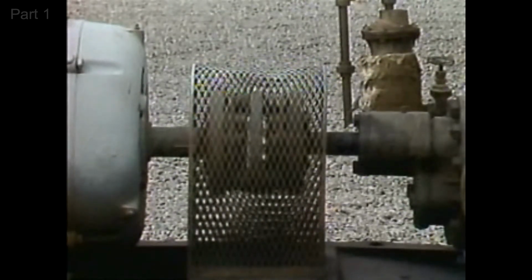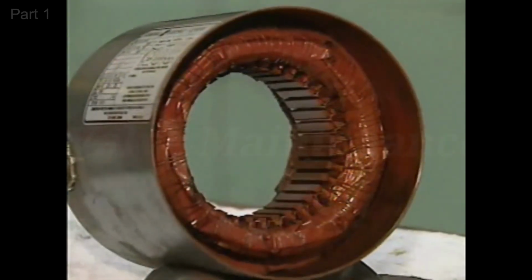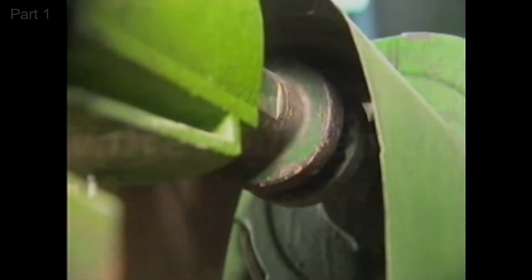When a typical AC motor is first started, current is 3 to 5 times higher than the motor's normal operating current. This surge of current could trip the power supply and in some cases may damage the motor's windings or the cables leading to the motor. In this part, we'll look at a reduced voltage start AC motor controller that can protect a motor against these current surges. Reduced voltage start motor controllers generally use resistors in series with the motors they control. The resistors increase the resistance in the motor circuit, which reduces the level of current during motor startup. After the motor is started, the resistors are bypassed, usually by means of an auxiliary circuit.